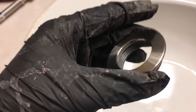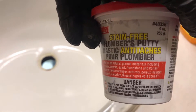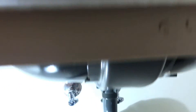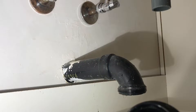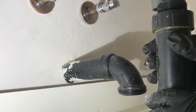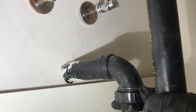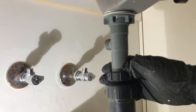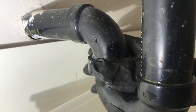Make sure you put some stain-free plumber's putty — this is the brand I'm using right now. Push the pop-up through, tighten it from the top, and then secure it from the bottom. To reinstall the p-trap, first push the side with the pop-up. This one at the top goes counterclockwise to tighten and the other one goes clockwise to tighten.